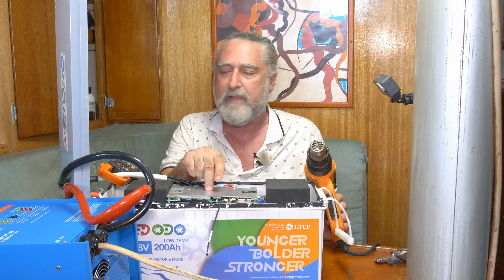We've got a heat gun here — this will use the power we need, turning it into heat in the room. I've got an amp meter here showing standby numbers. We're going to turn this on and bring it up until it's putting out its rated 100 amps. Then I'll pull out my thermal camera and see if anything gets warm — it won't right away, but we'll have a baseline. I'll let it run for about 15 minutes and do another thermal scan.